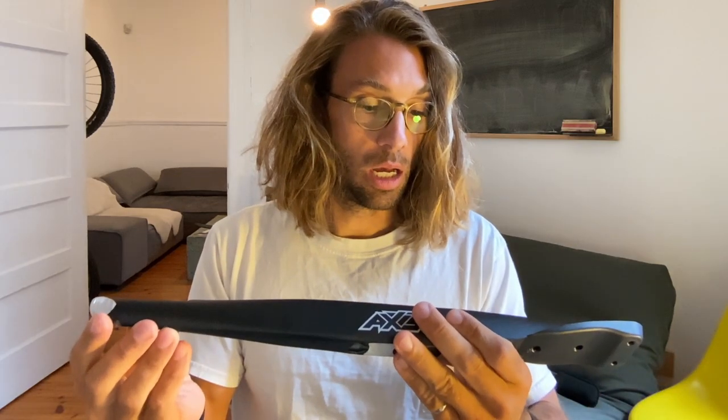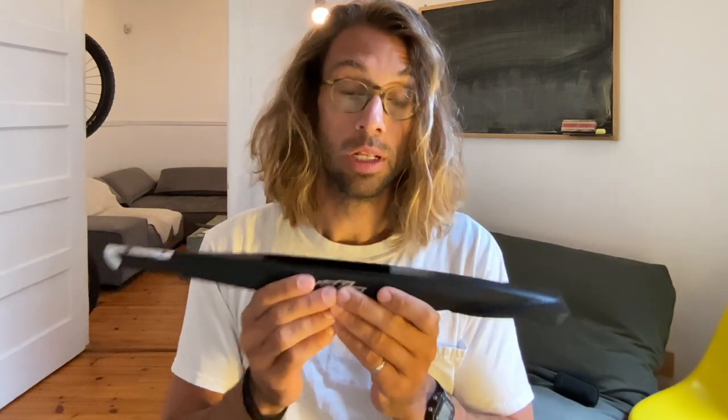You can also see I shortened the tail — I cut a big part off the tail that I didn't need. I machined that part to make it flat, tapped some holes into it, and made this part round. I haven't painted it yet because I'm not done. But this is the new result, and it's a lot more reactive, a lot more controllable, and more maneuverable than the original one.